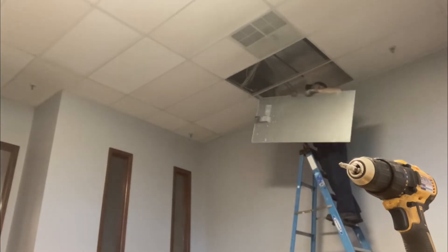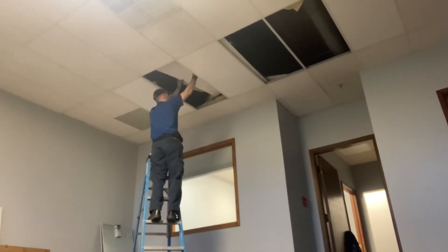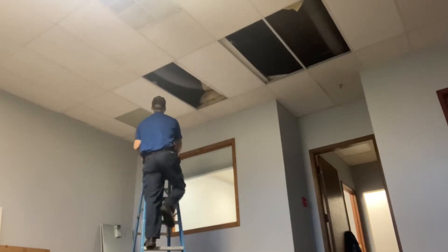These here are actually older LED panels — they still work great, but management wanted to replace them for a new style. So I'm going to remove these LED troffers. There's BX cable running to all of these — that's a flexible metallic type conduit. Remember to watch your head when working up inside a drop ceiling; you don't want to hit your head on some unistrut, a metal pipe, or ductwork.